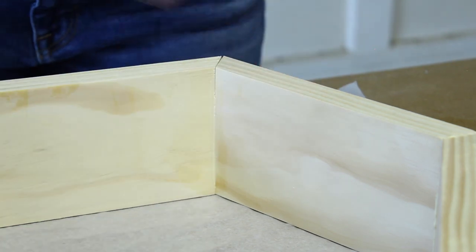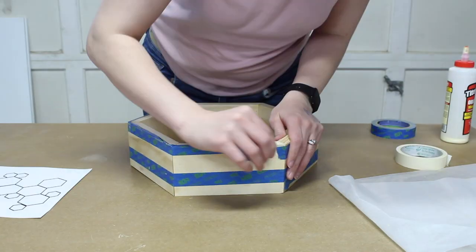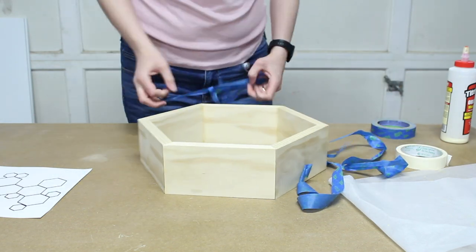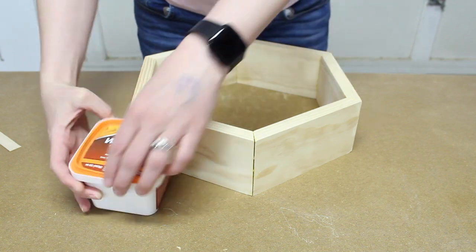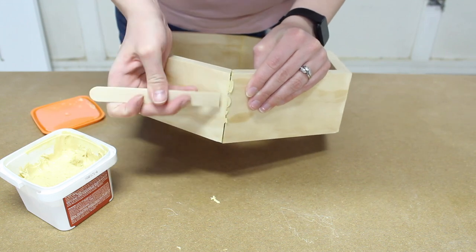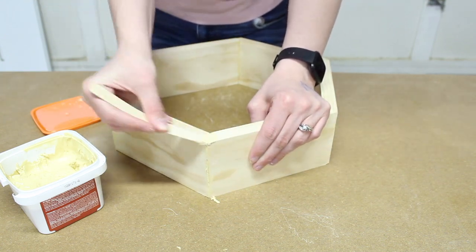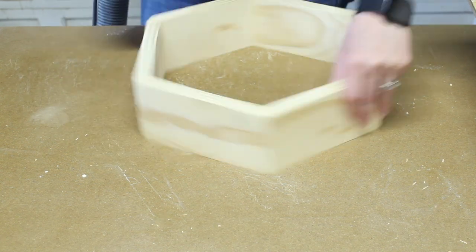Come back to all the joints — especially on the inside — and wipe away any glue squeeze-out, because it will be hard to clean up later. Then set the piece aside to dry. I let mine go overnight, and then I pull all the masking tape off and do a little finish work. You can see where there's a gap from my angles not being quite right, but that's not the end of the world — this piece is totally salvageable. I've got a little bit of wood putty and I'm just going to fill in that gap. Once I sand it away, you won't even be able to see it. I'll go around all the outside edges and the front face to check for any gaps, apply the putty, set it aside for 15 minutes to dry, and then sand the entire piece — front, back, and all sides on the outer perimeter of the hexagon.